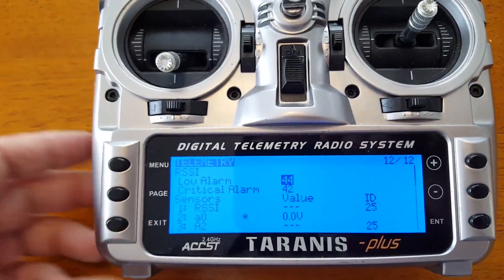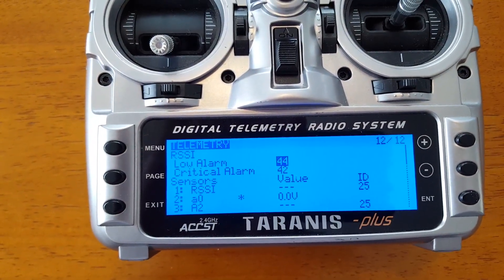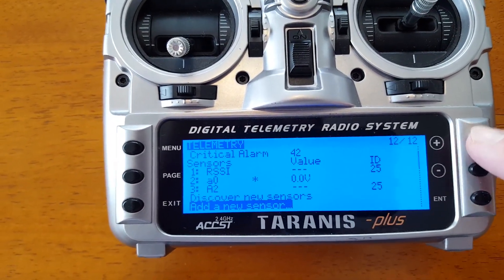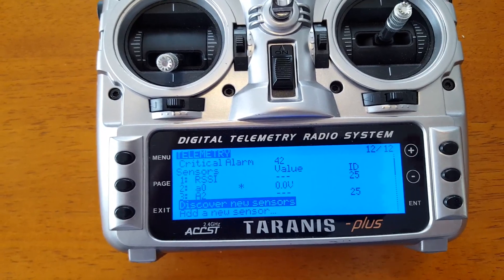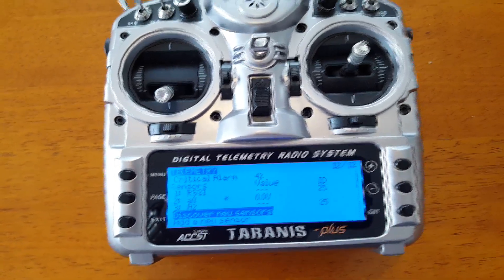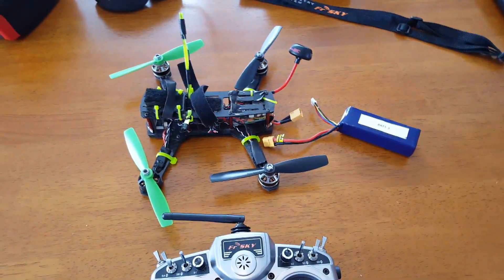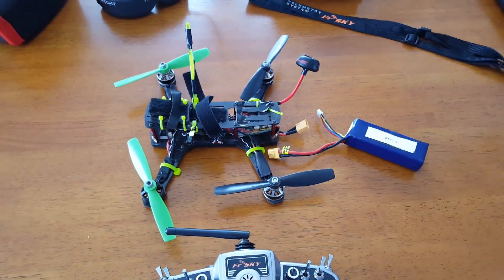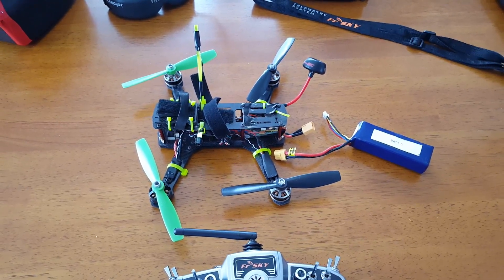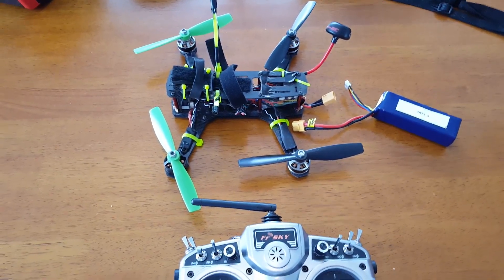Hold down page to go backwards. You'll see your normal telemetry is only showing your RSSI value, and there's no other sensors available because none have been found. So what we're going to need to do is discover new sensors. To do that, you're going to need to plug in a battery to your model and arm the Naze. The Naze will not show new sensors until it's armed. Once it's armed, the telemetry data will then be picked up by the Taranis while it's searching.